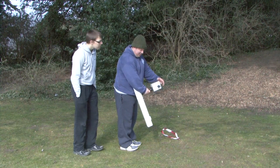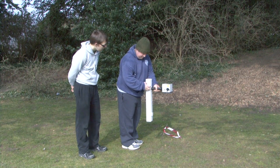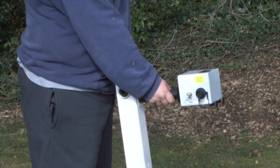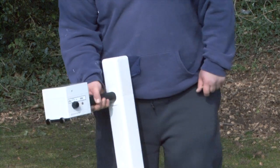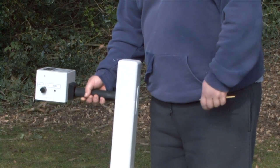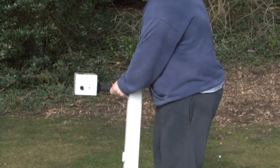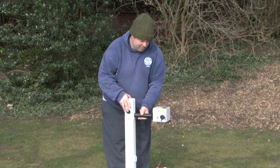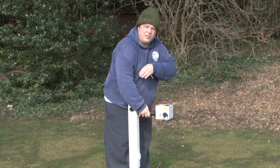Do the east-west alignment, so I'll just take this dial off. Facing east it's reading about plus one, plus two nanotesla. Facing west it's about minus six, so I just need to change the dial. Now it reads minus five, so that's calibrated on the east-west.